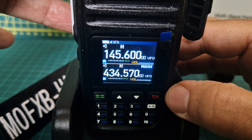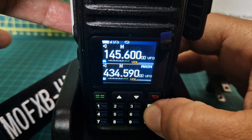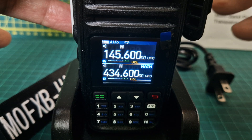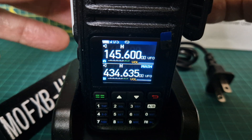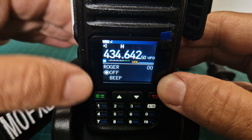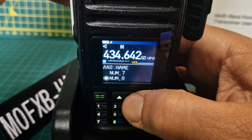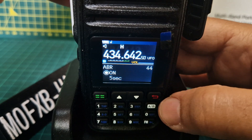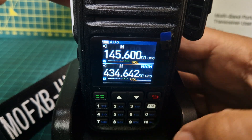We're in VFO mode at the moment. If we hold down the A/B button it scans - there we go, it's quite good. We can stop the scan with the PTT. The green button is the main menu - there are lots of items and you can go up or down. The one I always turn on straight away is the ABR one because that stops the screen timing out. The red button is a back button, and there's also an FM radio.